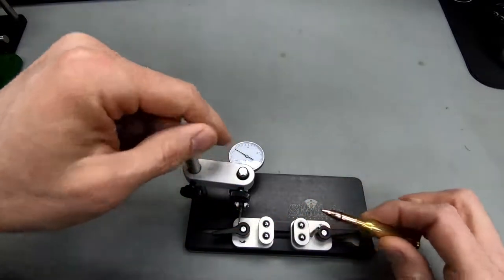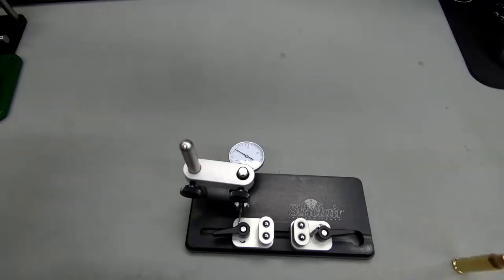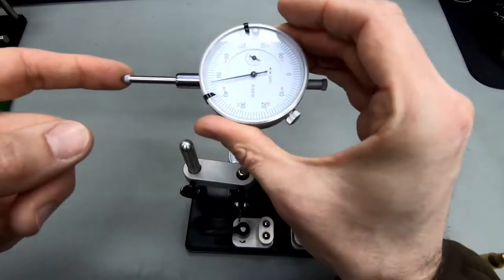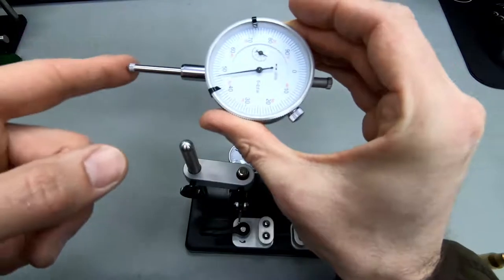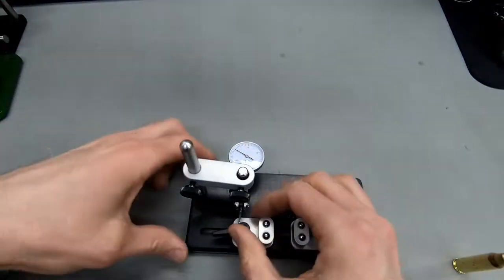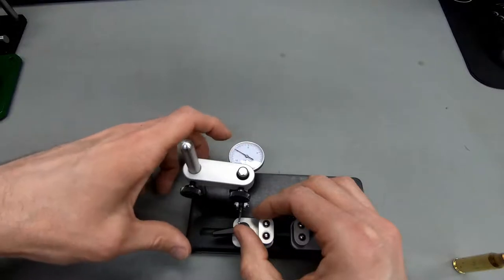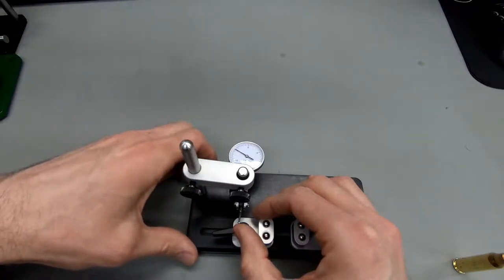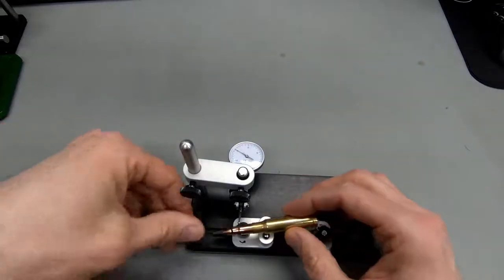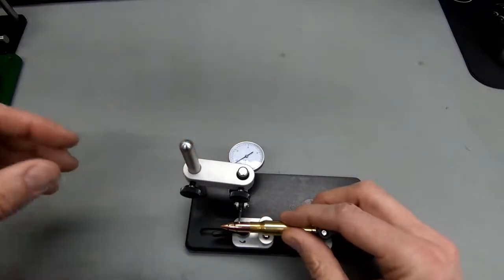These finger gauges, they have these little levers, these lever gauges. They have a tiny range they measure in. This one has a measurement range of, I think, half an inch. So see, this measures half an inch. There's other ones that measure like 1 inch of distance. This one, I think, is 0.03 inches. You can see one full revolution, I think, is 0.031. Yeah, I think it's got 0.06 inches of total measurement, because it goes both ways. You can push it and you can lift it. So be really careful when adjusting these.